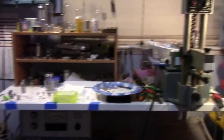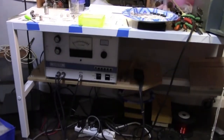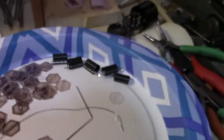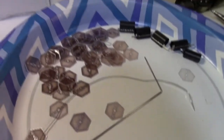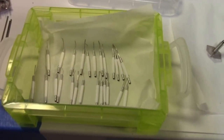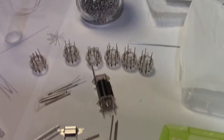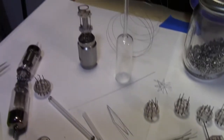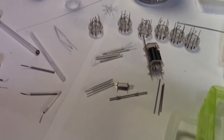I just wanted to quickly show you the parts that go into these little tubes and what I do it with. There's a little Unitec spot welder, another one with a hand-held piece, and a couple of little welding jaws for making the little fiddly connections. The actual mounts I just do by hand — I wrap the little anodes by hand, weld them, laser cut the mica spacers, and spray the cathodes. This batch has much more coating on it as an experiment. I pre-form the little leads on the buttons, stick it all together, use one of these little pin straighteners to hold it, and weld them together and test-fit them in a bulb before they're ready to seal.